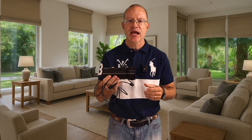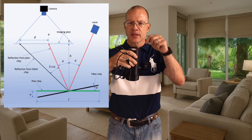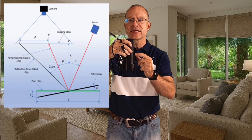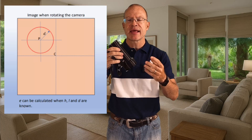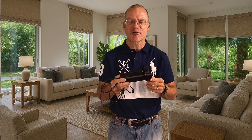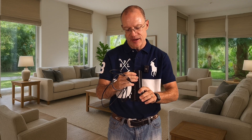It connects to a Windows PC through USB. You attach this to the camera at the end of your optical path — you don't even need the telescope for that. The laser goes down to the sensor, reflects back up, the internal camera records it, and by rotating the device it can calculate the tilt. You then have a live view, and while you're adjusting the screws you see right on your screen how the tilt is being removed. This thing is also 3D printed, which I think is pretty cool — it's not a huge company, just two guys with a great idea who made a nice little business out of it. Mine is serial number 169.